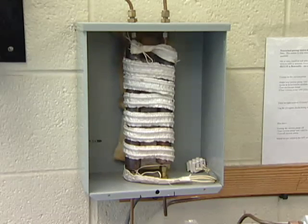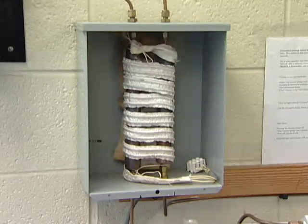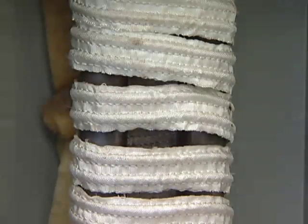The temperature is controlled by a rheostat. Here we have two columns for two separate gassing stations wrapped with a single heating tape. The copper inside is reduced by running hydrogen or a hydrogen gas mix through the heated column. Oxygen that is in the gas supply will react with the reduced copper and be eliminated as water. There are special precautions that must be taken the first time the column is reduced. The reduction of copper with hydrogen is an exothermic reaction, so caution must be used or the copper inside can heat up and fuse. If this happens, the column can become clogged or the gas path can be greatly reduced, lessening the efficiency of the column to remove oxygen.